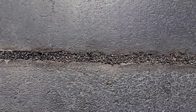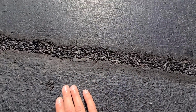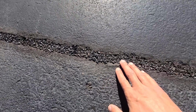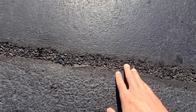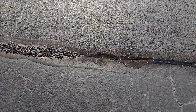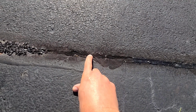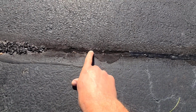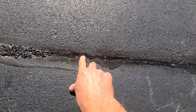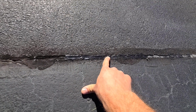This is the Quikrete Blacktop repair. So this is good for the big gaps, like this was a utility cut. You don't want to fill that with any kind of liquid filler because this is too deep and too wide. This is an example right here. This was the STIX one that you melt in with a torch. So that worked out pretty good here. And then this is some regular crack filler poured over that.